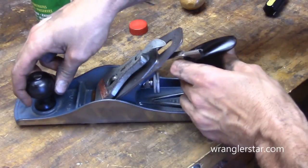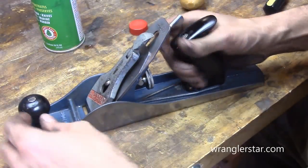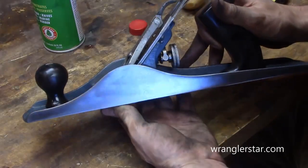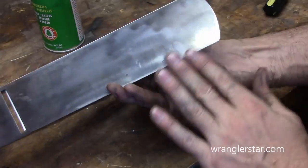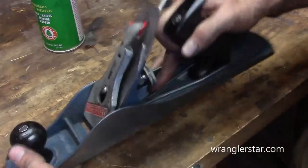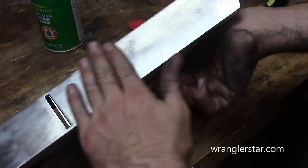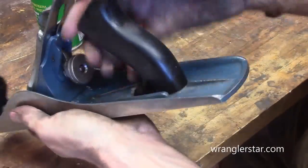Feels better. I didn't show you how the metal turned out. You can see the edges there — polished up real nice. You want a little bevel on the toe and on the heel there, which was already there. I don't believe this plane's been used too much. And also bevels on the sides. So when I was on the sandpaper, I just carefully tilted it up and polished and maintained those bevels. But it's a nice flat base. Not a lot of pitting in it. It really cleaned up nice. The pieces all look good.